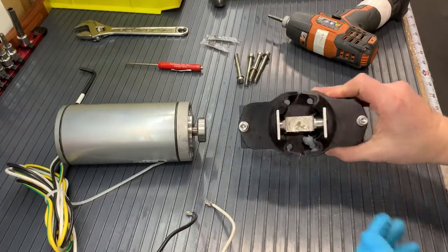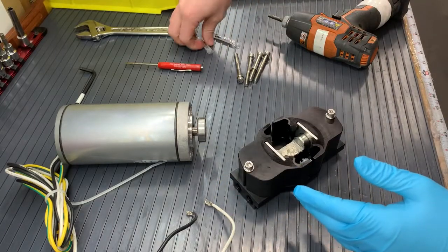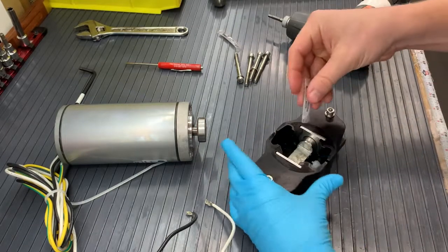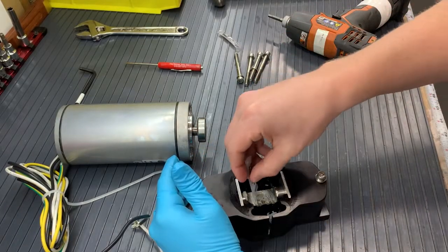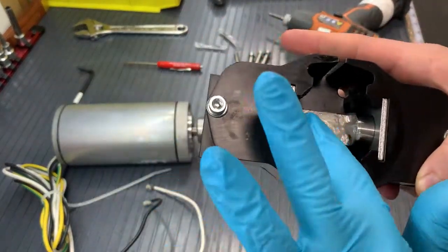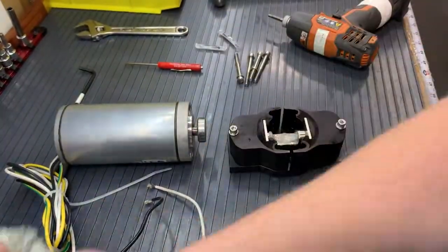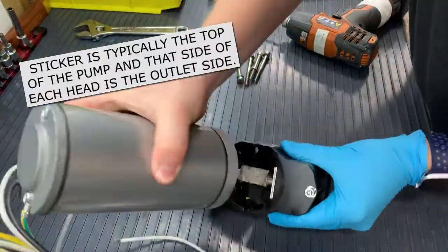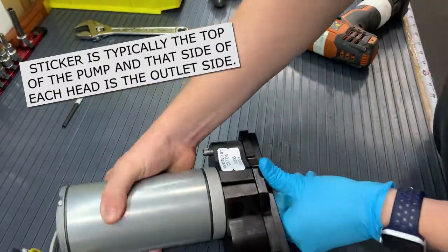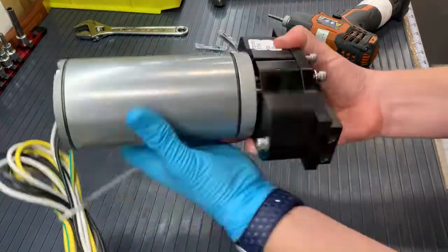If you replaced the parts in your pump, you probably ordered kit A or kit B to replace your valve seals and o-rings and whatnot. There should have been grease with those kits, and we'll use that grease now for the plunger. You want to put a generous amount across the plunger and across the walls that run perpendicular with the slot. The last thing to do is position the plunger back on the cam so that you can get the bolts on that secure the pump to the motor. You'll want to do almost a star pattern — one corner, across to the side, across — and then just do that same pattern to tighten.